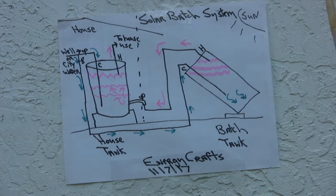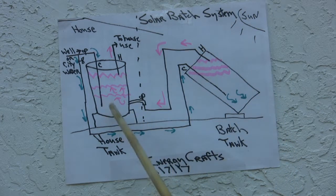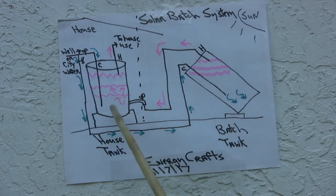The other thing that might be a cost savings is it's not just because of electricity, but it's also because of the fact that you have the possibility from the sediment issue that if there's no sediment in this tank, I think that the tank will last much longer. I don't know if that's true because it takes years to prove it, but I think that will be the case. This tank here is already like 12 years old, and I got it for free on Craigslist, so if it fails, it's not that big a deal to me. This tank is 7 years old, and it's at that point where the warranty is over, and it could fail any time. But I'm curious to see how many years I can go by constantly keeping the sediment removed from the bottom of that tank.